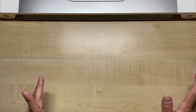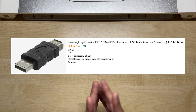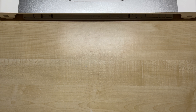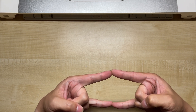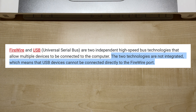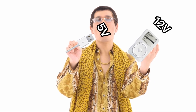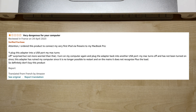Finally, a word of warning. You might see Amazon listings for USB-A to FireWire 400 adapters and think this looks like a cheap and cheerful solution. Well, I've only got one word for these adapters: don't. These adapters are scam products, pure and simple. All they do is join the voltage and ground pins between USB and FireWire — there's no regulator or controller between them. USB-A and FireWire use completely different protocols, and it's not possible to convert from one to the other. If you plug an iPod into your PC this way, the USB port will supply 5V while the iPod tries to draw over 12V, and it's not going to end well. People have actually fried their USB ports, so don't touch them.